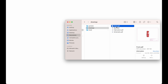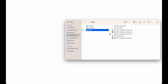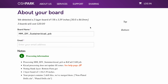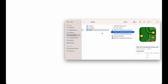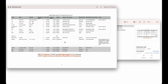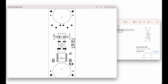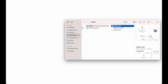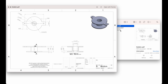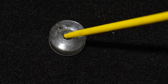I've also included PDFs that show the board layout. If you just wanted to order some boards but didn't want to order them from me, you can just upload the KiCad board file to OSHPARK - that's kind of surprisingly expensive, and what you'll get is just a board that doesn't have any components on it. Also in this repository there's a list of all of the components you need, both for the board and for the inductors, with part numbers and suppliers. There's also a PDF that shows you where on the board all of the parts go, so you could use that to assemble your own board. For the inductors you're going to need a bobbin, and all of the design files for the bobbin are here including an STL file which you can directly 3D print.